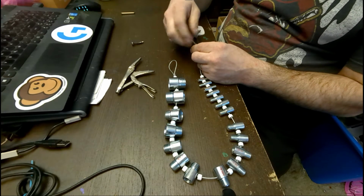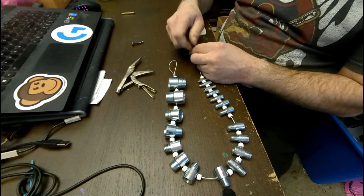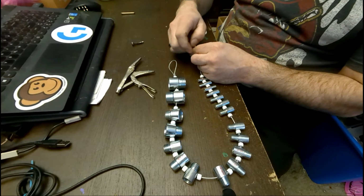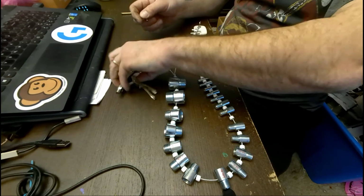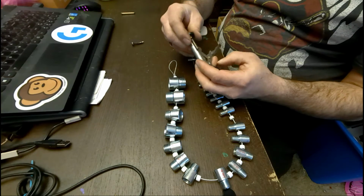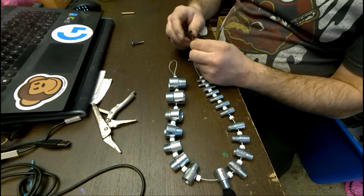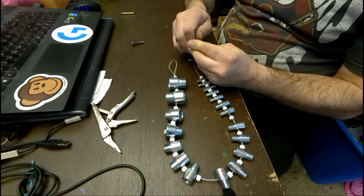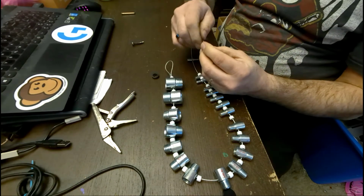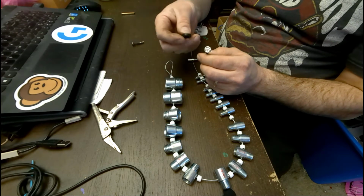So what I ended up doing is getting the bolts, figuring out the length of the bolt that I needed in order to have the pliers lock fully. That I did by basically screwing it in all the way till it locked at the teeth. Once I figured that out, I actually had a secondary screw, because I would have used a nut, I just didn't have any 10-32 nuts, so I had this type of screw.